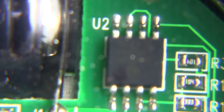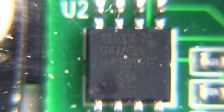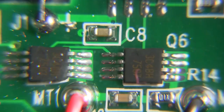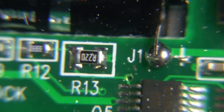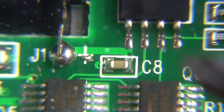You can kind of see the markings on the microcontroller here — it's a Microchip-branded microcontroller. You can actually read the numbers through here: it says 12LC671. So that's going to be what's controlling everything. These down here appear to be probably two half H-bridge drivers, since there's one of each of these going to the motor. There's one of the contacts for the battery — that would be the positive side. It's just some little bypass cap. There are some resistors up here. You can see the two wires coming down from the microcontroller going into the H-bridge drivers — it's a really basic setup.